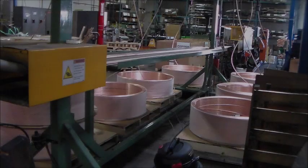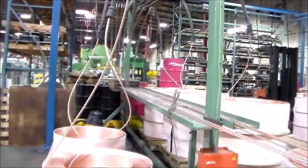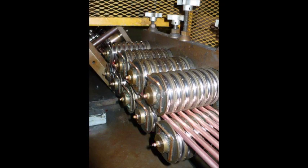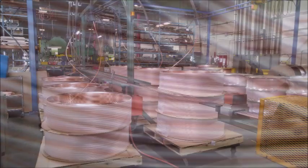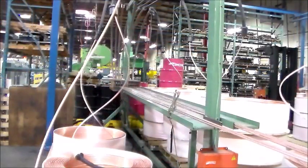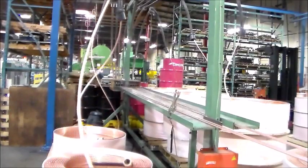The overhead spiral uncoiler system uncoils the copper which is brought in on a pallet and stocked on both sides. Start the coil from the center and feed the end up into the entry guide tube above each coil. Feed through until you can grab the tubes from the end of the table below the entry guides, then push or walk the tube to the machine end of the table. Trim the end of the tube if needed using a manual cutter, as the ends must be able to fit over the mandrel tip. Feed the tubes through the guides and straightening station until they are at least halfway through the feed belts. Each tube must pass through its own straighteners and rollers, with number one being closest to you and number seven the furthest. Be aware that you may have to pull some of the inner wraps of the coil to prevent kinking, especially as you reach the bottom of the coil. Sometimes the material arrives damaged, so inspect the tubing while operating, as the machine will not function properly with severely damaged material. The straighteners can only round the outside of the tube; they cannot fix any indentations on the tubing.